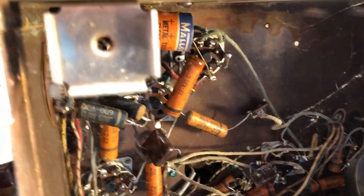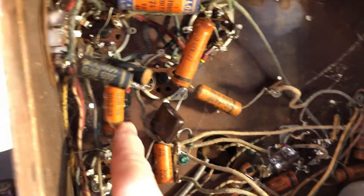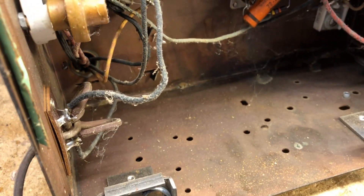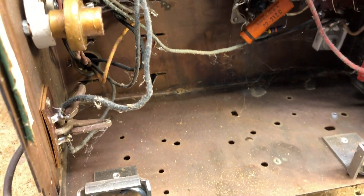There's really no easy way to unplug it and I don't want to unsolder the wires and solder them all back. Under the chassis, it looks like a bunch of original Zenith capacitors, and there might be some replacement ones — replacement Mallory electrolytics — but mostly original wax paper caps in here. We're going to dive into that in a minute, but first we're going to check the transformer to make sure it's not open.